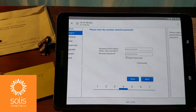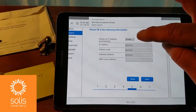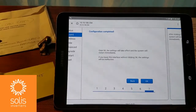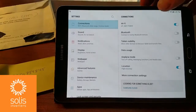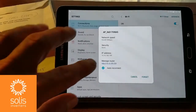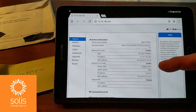You can see it's connecting — this is the pairing process. Now we're going to obtain an IP address automatically. Configuration is complete. After the configuration is complete, we can check out that network connection we just made. Go into the Settings area and look under Connections and Wi-Fi. You can see I'm still connected to that Wi-Fi stick network. Let's take a look at that network and go to its IP address to see the status. Under status, we can see it's enabled and we're now associated with the home network here at this site.